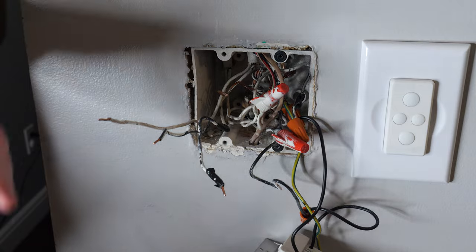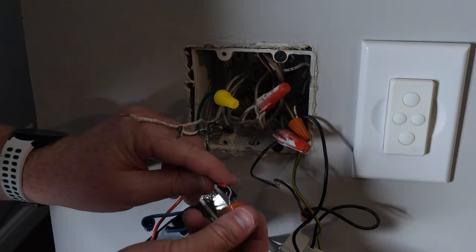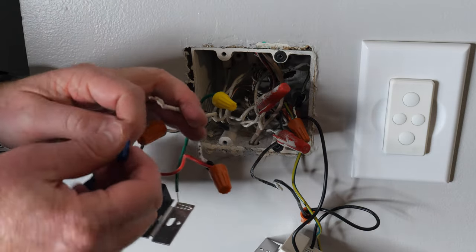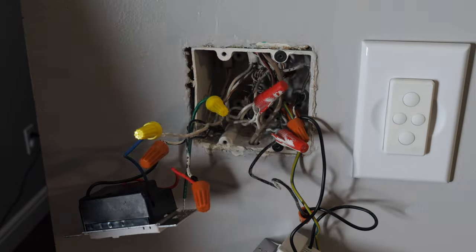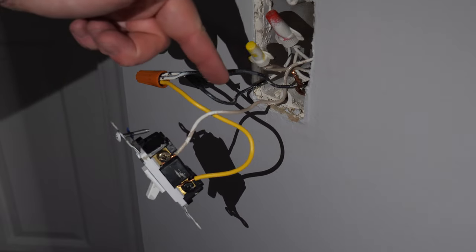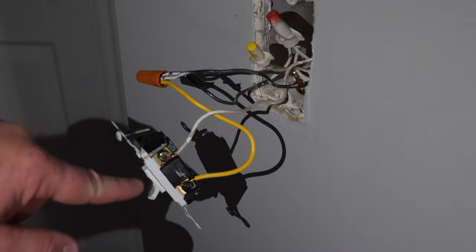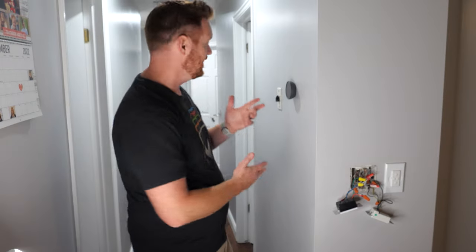The wiring for the Diva will be very similar. The only difference is you do not use the neutral wire. We connect the ground, then the load wire, black to black, and the other color traveler to the blue — it could be red or white. The neutral just stays there and we don't touch it at all. At location one, the line or hot coming in is connected to the jumper wire and the black traveler wire, and those are connected to the common on the mechanical switch. The white traveler wire connects to the brass, and that goes to the blue cable on the switch. Once I turn the power back on everything is working.